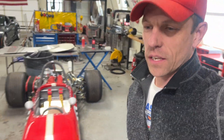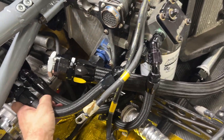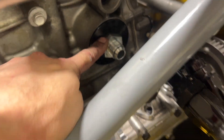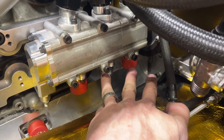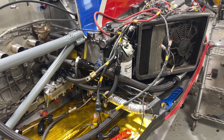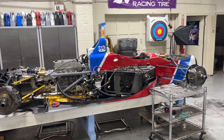Aiden is doing a really good job here. We're working on what we call the sarlacc pit — these are the fittings. There is where the oil has to go into the motor to pressurize it. Here's the pressure stage of the dry sump oil pump, and then these two are scavenging — they suck out of the pan right there and right there. There's a lot of things we have to do very tightly to make that work, but it's going well — it just takes time.